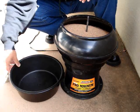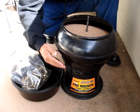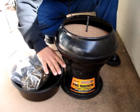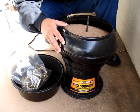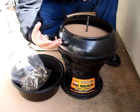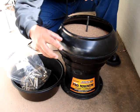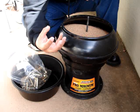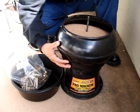Let me be brutally honest — this thing is a total, complete 100% piece of junk. It does not work well at all. Number one, it is super loud. Once the media starts trickling down and it's still tumbling with just brass in there, it is super loud. Number two, it's going to leave massive amounts of dust all over the place as the media pours into the black bin. Number three, when you have large amounts of brass in the tumbler, the brass does not rotate and flip around like it does when it's full of media. The brass will sit and solidify within each other, so the media does not go away. This thing is going to make massive amounts of noise, massive amounts of dust, and the media is still going to be within the cases.